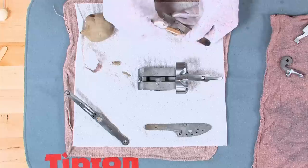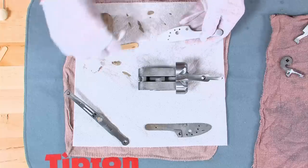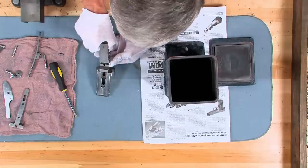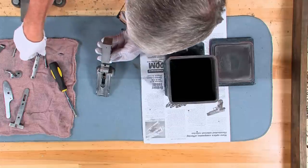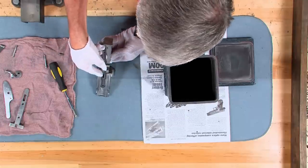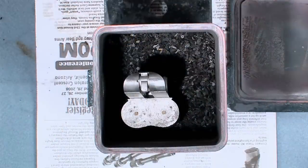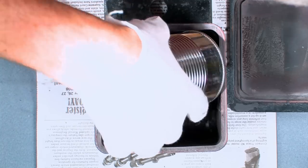I put clay in each of the pin and screw holes. This prevents scale from developing in the holes. A steel block secured between the tangs of the receiver will help prevent them from warping. After filling the crucible about half full of charcoal, I put the receiver in tang first, making sure to leave at least an inch of charcoal below the tang.